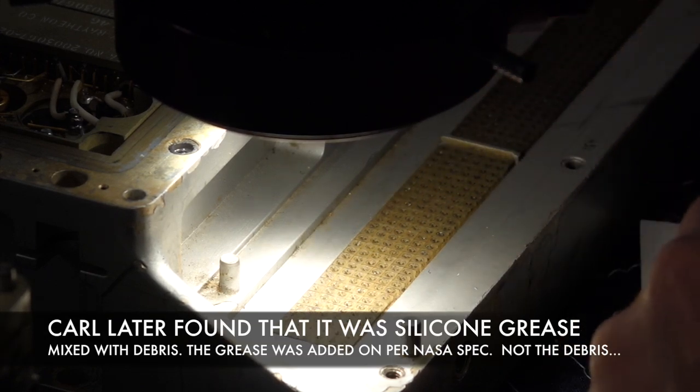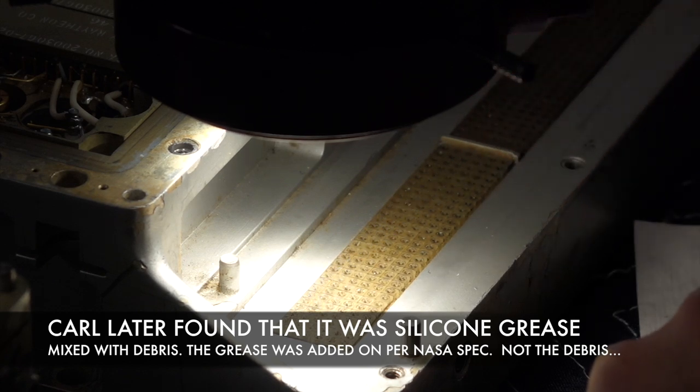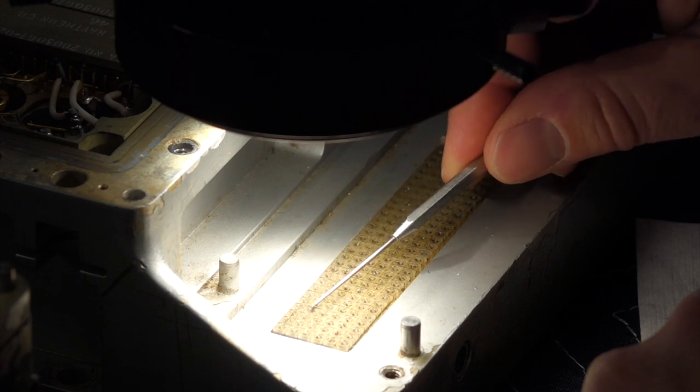I really have to get in there — I just milled this tool this morning. It's a dental tool that I made much smaller. I don't want any particles. It's about 10 minutes per connector, and we have only 360 pins. I am making some progress: that's the unrestored section — vacuuming and propanol wiping is all that does, and the crud still gets there. But if you get to the restored part and actually get the crud out with the modified dentistry tool, then you can get it looking reasonably good.